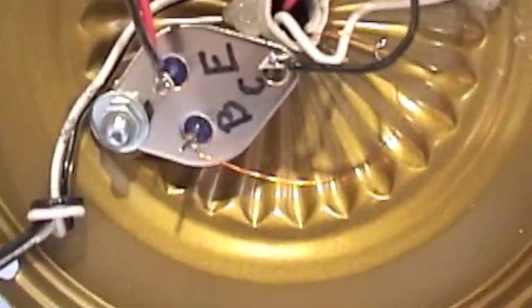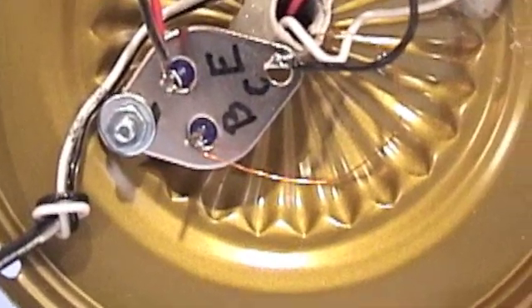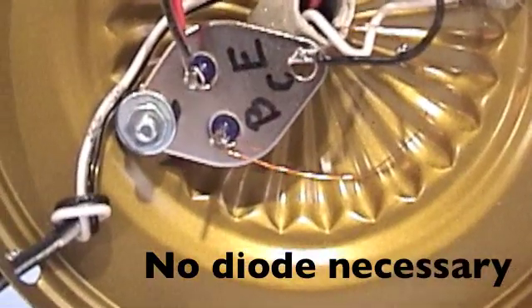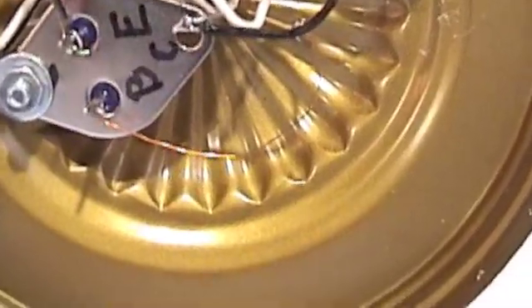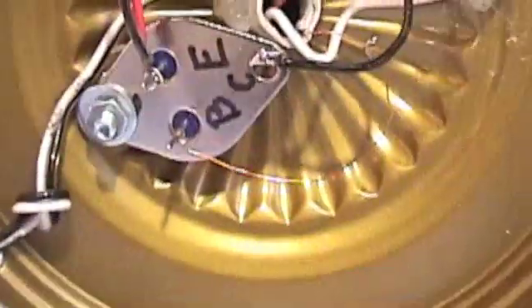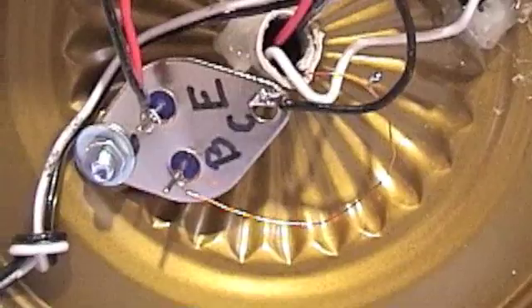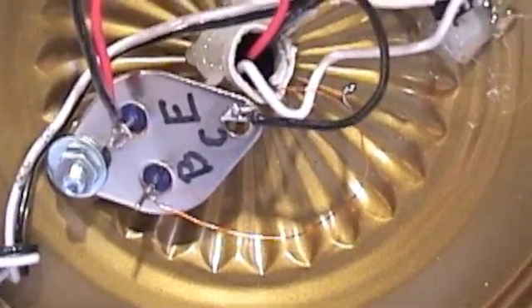Here's an easy fix if you want to use 12 volts: I tore the little transistor out and bolted in this power transistor - it's a 2N3055. It wires up the same way. The only difference is the collector gets bolted or soldered onto the housing. This is the return wire from the bulb, and this is the emitter with the negative. It runs really nicely on 12 volts.